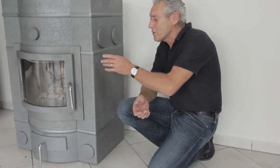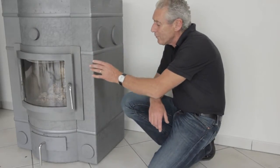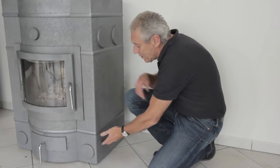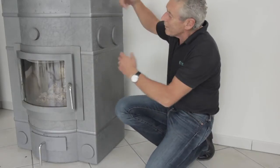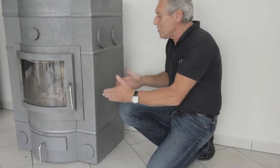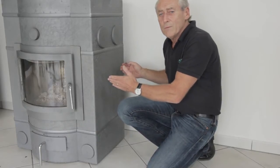One of the major parts of maintenance with a slow heat release appliance — the Eco Stove being an appliance with contraflow flue gas channels that run down through the body of the stove, underneath the bottom of the stove and up through the back of the stove on the left and the right hand sides — is that these channels will need to be cleaned out very frequently.